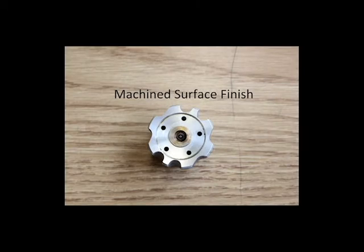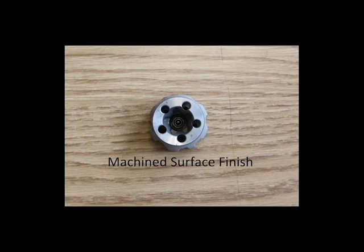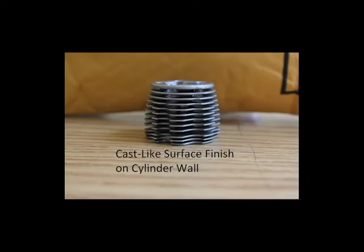After it was die cast, it was machined for a better surface finish to mate with another part. It also was machined with 5 holes for the fastener screw. We believe that the aluminum was injected from the big ends of the cylinder and was machined off afterward.